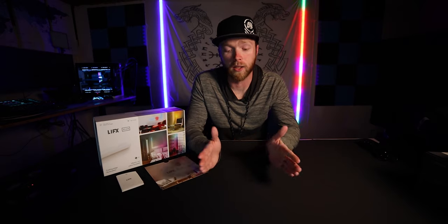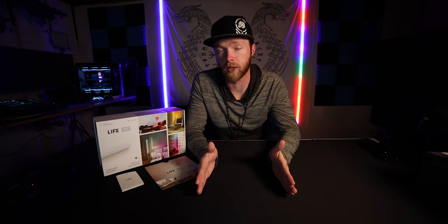Let's talk about some specs. Each kit comes with six straight pieces and one corner piece. Each of the six straight pieces are 11.8 inches by 1.3 inches, and each has 10 zones of RGB, as you can see moving here. They have red, blue, and green colors as well as white, which is capable of over 16 million different color combinations. The power draw is 27 watts with six straight pieces and one corner piece at full 100% power.